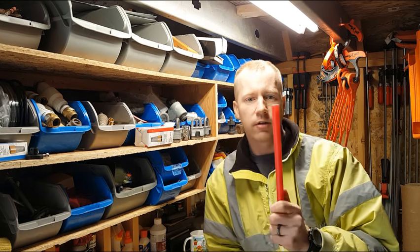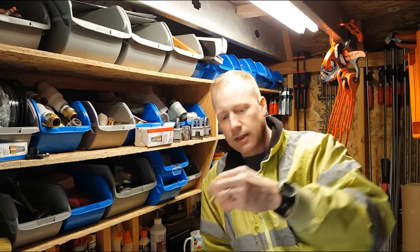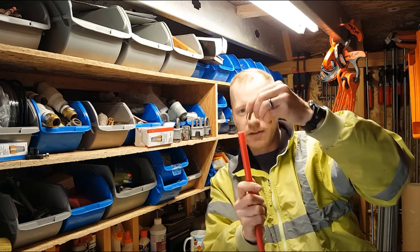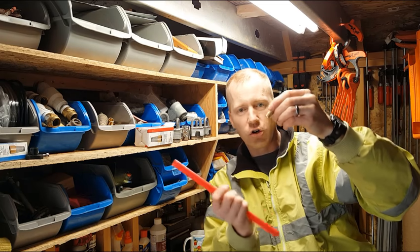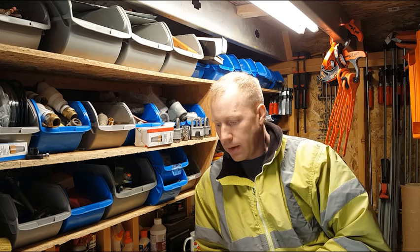And it's very, very difficult to get them lined up straight and try and get the fittings to go in, because the pipe's always constantly trying to curl off. So I would recommend getting the straight sections. Don't get the big coils unless for some reason you know that you've got a really, really long stretch and you got a lot of room to play with and you're only putting a few fittings in. So yeah, that's about it for PEX tubing.